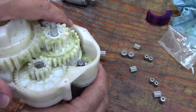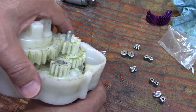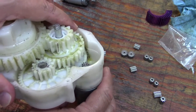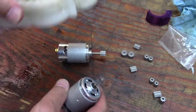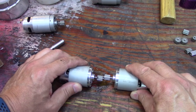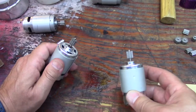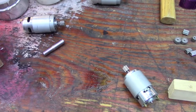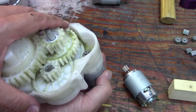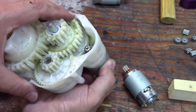I'll put it back on the press and take it back what looks to be about an eighth of an inch, and it'll be fully engaged. One way to check is to put them head to head and make sure they almost touch - which they do - so you know they're pressed in about the same depth and will go into the gearbox about the same. Double-checking in the gearbox, it is a little proud but the back end of the gear is also in contact, so this is a good fit.